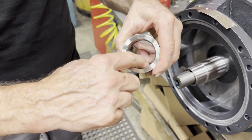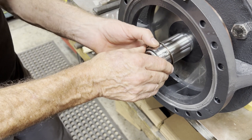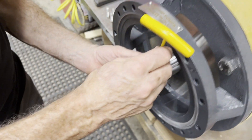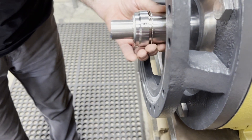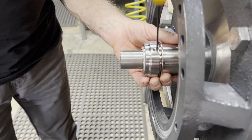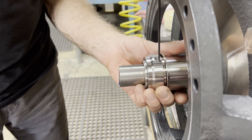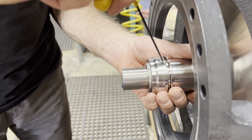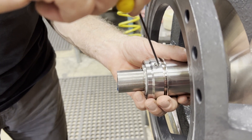Put a little bit of lubrication on the O-ring in there. Push it all the way back against that shoulder and then tighten the three set screws. Again, we're going to do this in succession and snug them down evenly, and then go in and tighten up all three set screws.